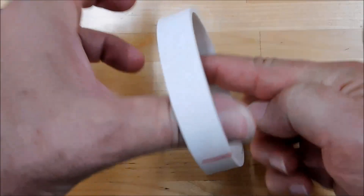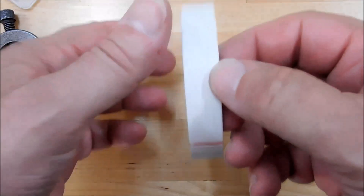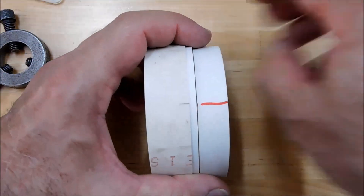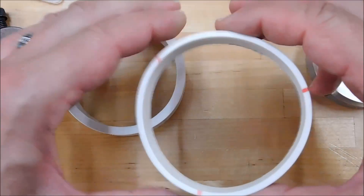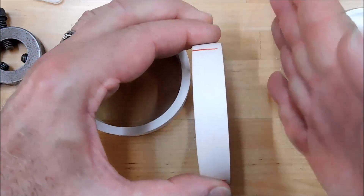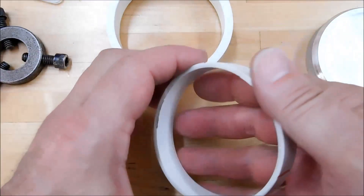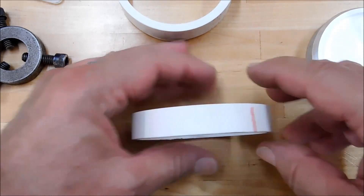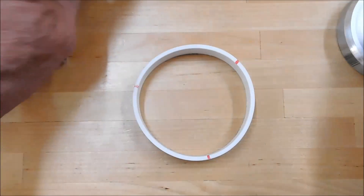Let's throw this back in the machine, find those high spots, and cut them down. The way I'm going to do that — I'm going to sandwich it. I'm going to hold it this way. If you have a delicate feature and you know pressure is going to influence that feature, stay away from it. Do it this way — sandwich it. Same thing with an extrusion in a mill vise if it's thin and it's going to crush when you squeeze it. If you can, turn it sideways. If you can't turn it sideways, well maybe bolt something to it and hold onto that.